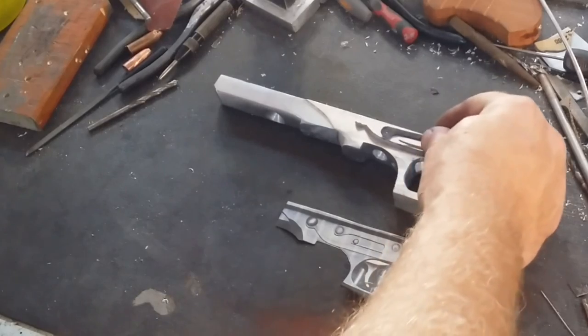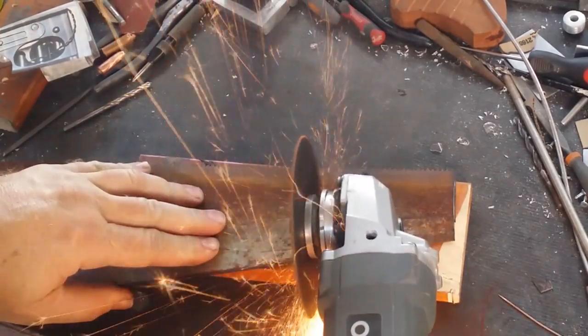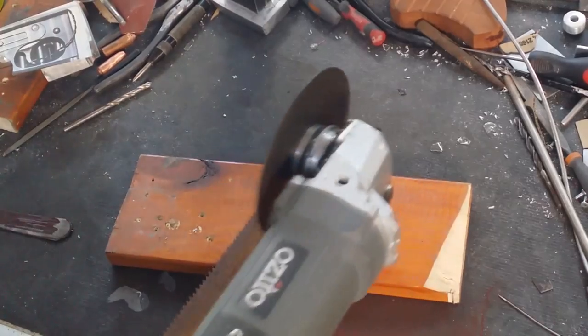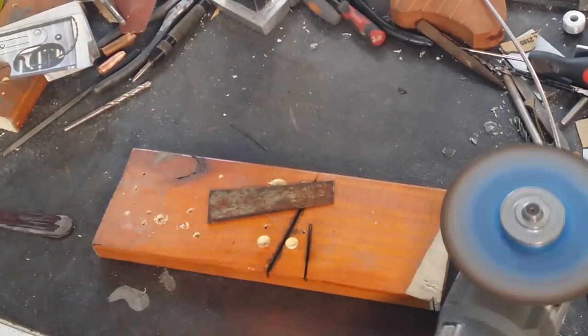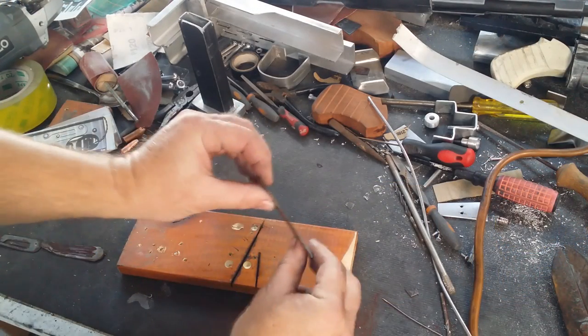Within the real assembly, this would normally be a piece that holds the trigger in place along with the levers on the opposite side. In my instance, this will be a more ornamental piece than was used in the original. So rather than making it up in a piece of aluminium that I'd probably have to work out some way of gluing on, I've decided to make it up in the same sort of traditional material that they would use, which would have been a spring steel.